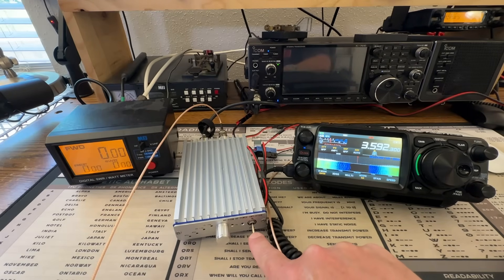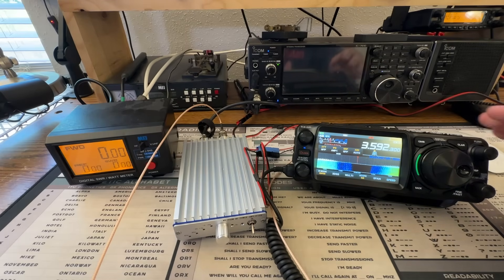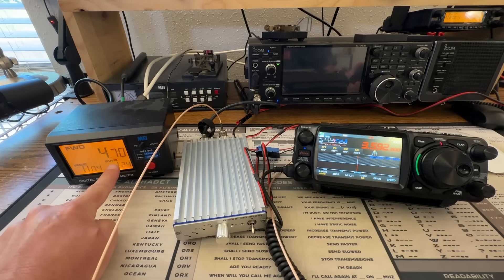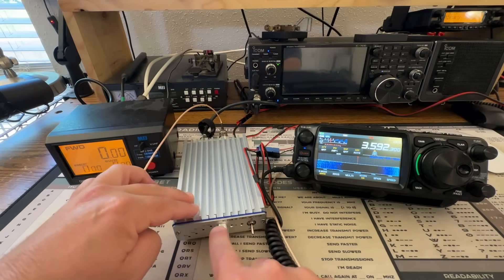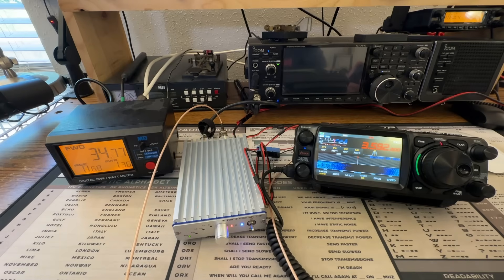So right now the amplifier is in the off position — it is powered on, but that just means the amplifier circuit is turned off. I've got 5 watts going out on CW. We're going to call that 5 because it's MFJ, and who knows the actual accuracy of that. Make sure this knob is on 80. Now let's turn the power amp on. Watch this red light and watch the power — 5 watts going in, 35 watts going out.